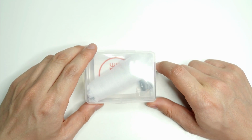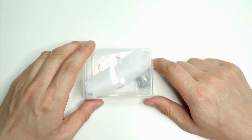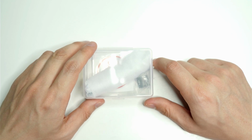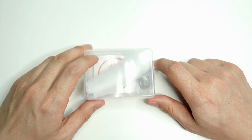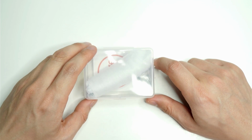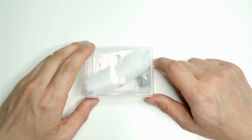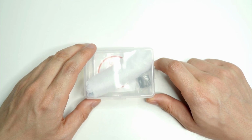It comes with a Nichia 519A LED. This LED, when you're using it with a normal alkaline AAA cell, you're going to get about 90 lumens, and with the included cell you will get 240 lumens on the highest mode. So interesting LED. Also it is 4000K, so it's quite a warm LED. I don't think I have a flashlight that is actually this warm.